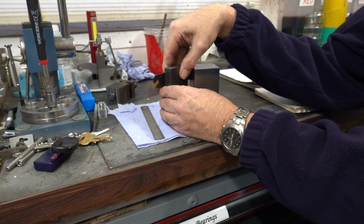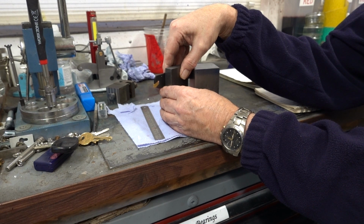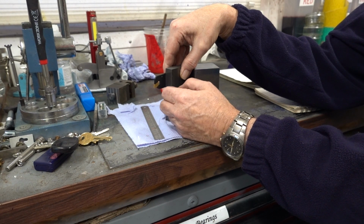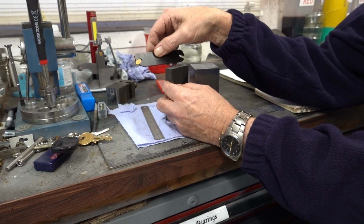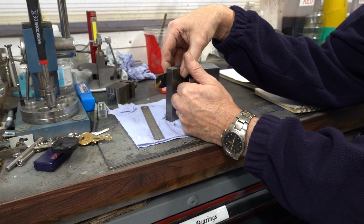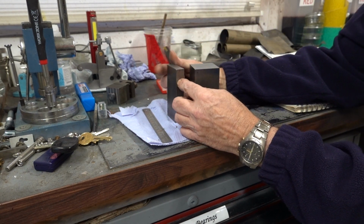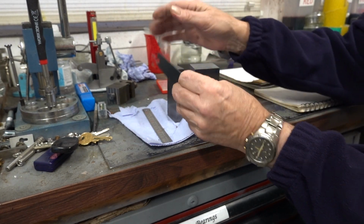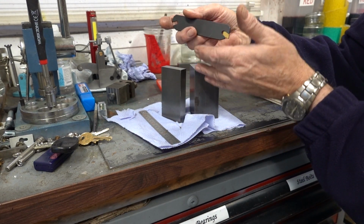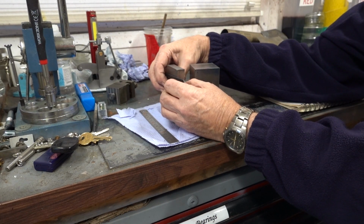which you can't do on the Myford one, and well, most of what people have made, you can't do that. It was just a bit of an Achilles heel that I could see, that if you ever wanted to go with a longer tip, or it came with a different tool that was the same dimensions but made by a different company and ended up slightly different, you could compensate for it within the adjustment that I was going to afford it. It's going to have a dovetail in the top to accept this sharp edge up into it, then sit back, and then it's going to have a keeper plate with half a dovetail in it, taper, to clamp it and push it tight with two bolts.